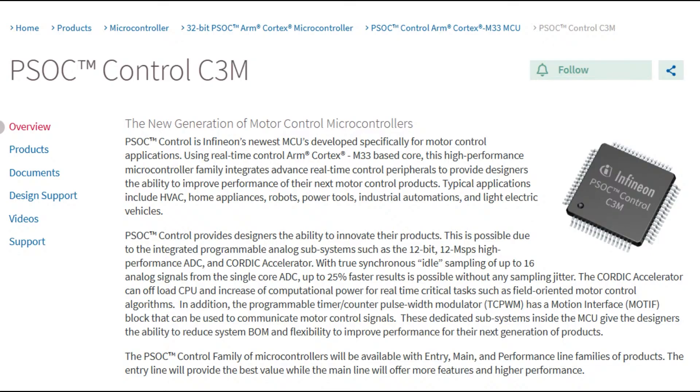A lot of companies are making chips with ARM cores or RISC-V cores, and they just kind of layer on the extras. So you've got the basics, but whatever is their special sauce gets added so you get to take advantage of the CMSIS libraries and the compilers and tool chains you know and love for the ARM Cortex, but you get something special that other chips don't.